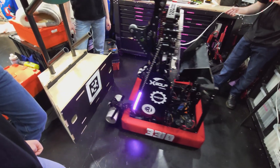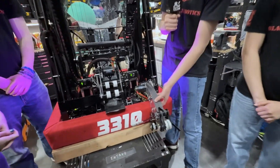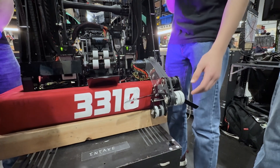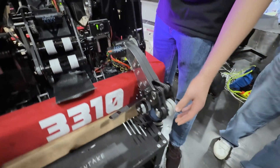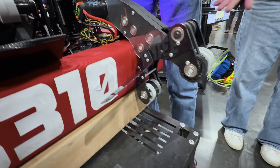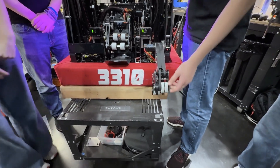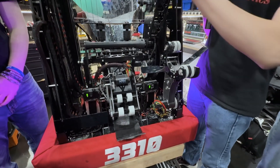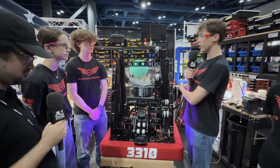Recently you guys added this L1 joint mechanism — talk to me about it. So this mechanism is kind of like a little arm. We added these to keep the coral from going off the edge. We use two Kraken X44s — one as a joint and the other to move the wheels. These wheels are constantly spinning inwards during the match, not by a button. The coral goes in, we run it up against something, and when we're ready to score, we ram up against the reef, point it upwards, and shoot it out really fast — faster than any other moving wheel on the robot besides maybe the drive.